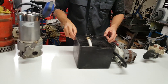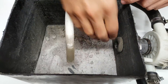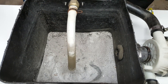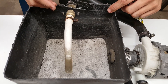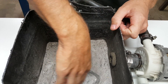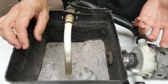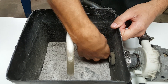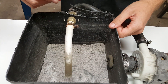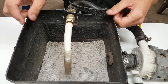There's another thing to work out with your reservoirs. Right in the corners here — if you've got your water circulating and it's blowing everything up into the corners, you'll end up with just a little bit of media agitating and running through the pump while a lot of the media builds up along the sides. The smaller amount of media in the agitated area will deteriorate really quickly, and you'll end up throwing out all that media even though half of it is still good. So you have to make sure the agitation jet actually stirs the entire reservoir area.